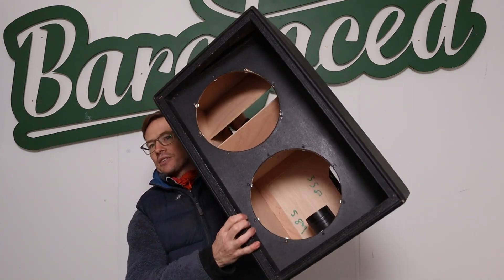The other issue was that this design uses two speakers — one speaker giving you your tone and the second speaker generating further output. The problem with having two speakers is: if you've got two tens, you can go smaller with two eights, but is an eight inch guitar speaker going to sound like a 10 inch guitar speaker? Does a 10 inch guitar speaker even sound like a 12 inch? And I will say that when people talk about speakers having a sound — eight, 10, 12, 15, 18 — they don't have a sound that's characteristic to the diameter of that speaker. However, if they do have colorations that relate to the diameter, you sort of get tied to them in strange ways.